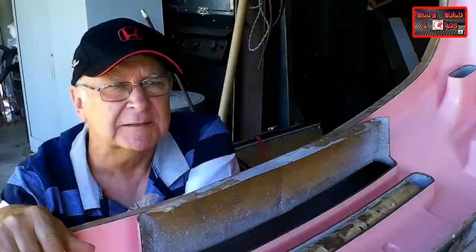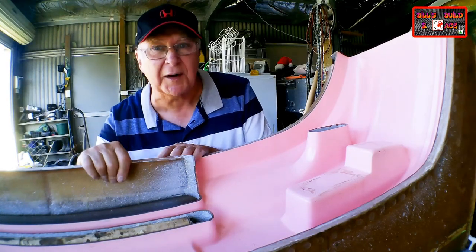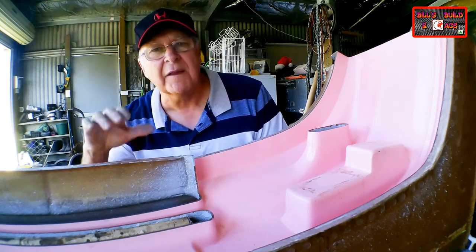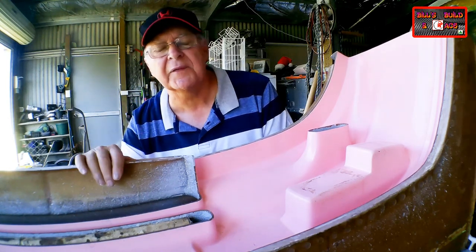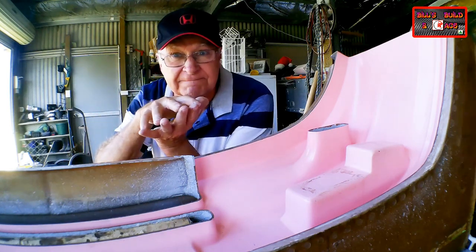Why? Because most glues do not adhere well to hardened fiberglass. Sooner or later, it's more than likely that your edge joints will crack on a hollow structure. And it is very difficult to get every edge to line up exactly.